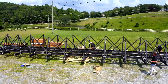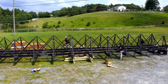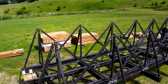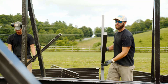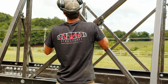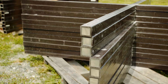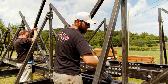After bottom lateral members have been installed, we can add the vertical X-bracing or, depending upon your bridge, single diagonal members. If your bridge has X-bracing as this one does, note the orientation — because our bridges have a positive mechanical camber, the X-bracing is slightly wider at the top than at the bottom, and this will be labeled on each piece. Two other considerations are: first, the location of the plugged bracing versus the unplugged bracing; and second, the tension and compression orientation of the member. Refer to your specific plans for this.